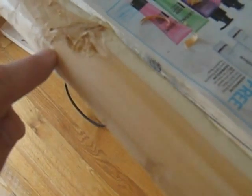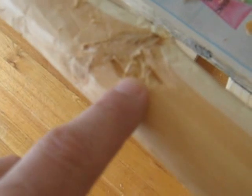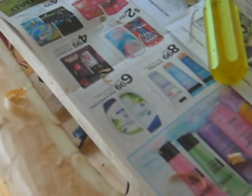I want to demonstrate a technique of carving around knots, which will enable you to get good wood and kind of try and pass on a bit about reading the grain. There's a spot in the wood here on the side of the knot where the grain changes direction. From here I'm cutting towards the end — if I do that in this area, then it tears out, as you can see from what happened when I was chopping it down to a two-by-two. So I'll take this spokeshave and demonstrate how to work with that and get the wood around both sides of the knot smooth.